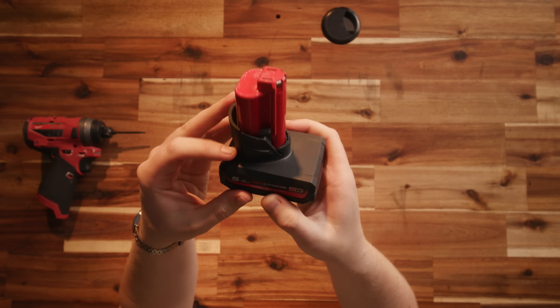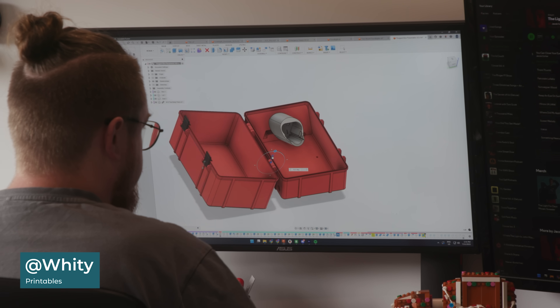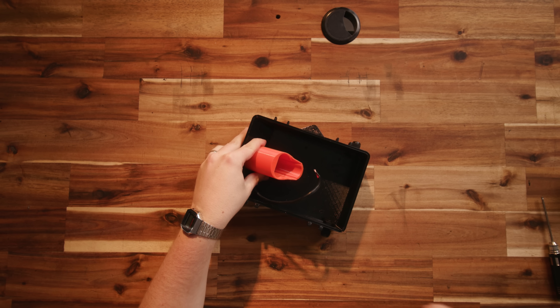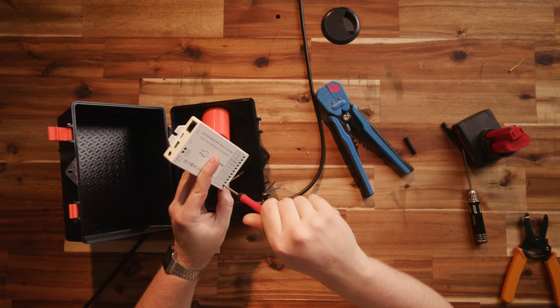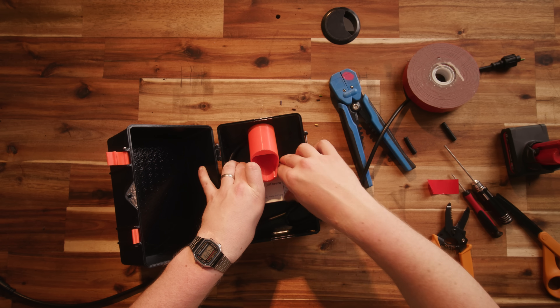We'll just need to jump on a ladder every few days and swap in some spares. I also found a model for a battery receiver to use as the basis for my own battery box. The batteries and WLED controller are obviously not waterproof so I needed some kind of enclosure. I grabbed the good old parametric rugged case model from Witte on Printables and tweaked it into my own waterproof enclosure. I built in mounting points for my Milwaukee battery receiver, added relief for routing the cables, and some spots for waterproof cable glands on the sides. There's room under the battery for our WLED controller. Sorted.